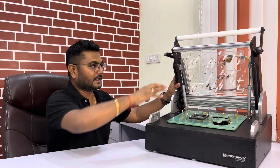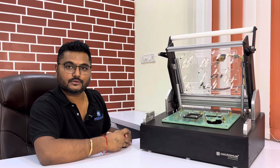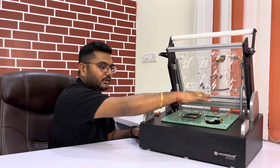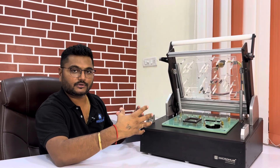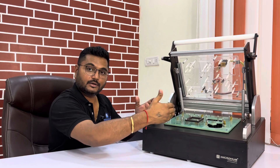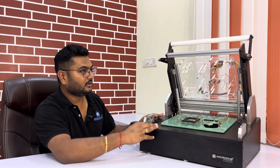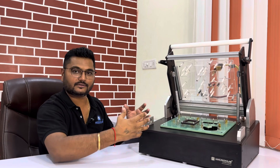As I said, the fixture moves in a radius and delivers a parallel stroke. When to use this fixture: when you need a large space to place the UUT PCBA, this is very useful — we have great space to put the PCBA in and take it out. Also, when we have different types of PCBA, we have an adapter plate that we can remove and insert a new plate for a different PCBA. This fixture is also very easy to use and easy to access from the operator's point of view.